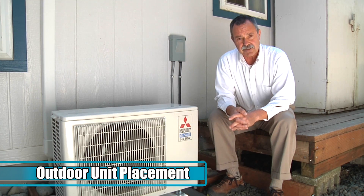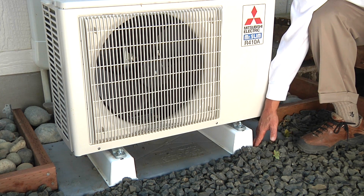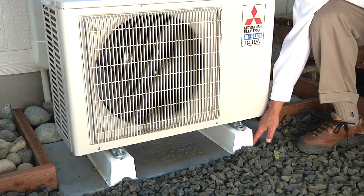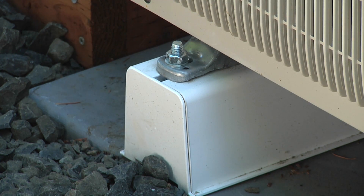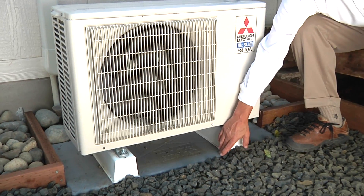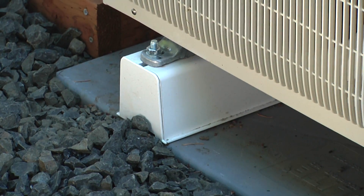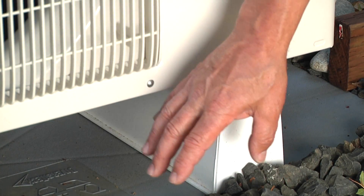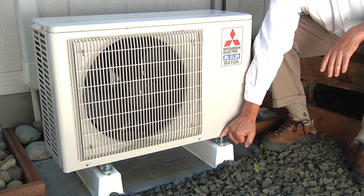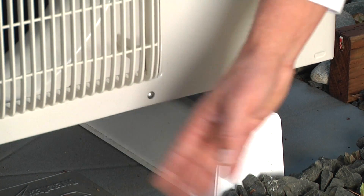The key to getting a good unit install is to start with a good stable foundation. As you can see here we have a good pad that's connected well with the ground. We have these risers and then the entire unit is bolted through the riser into the pad. This allows for adjustability and a good stable operating system. The space is very important — without it we could not clean any debris that might block the unit from underneath. In snow the risers might be a little higher. Additionally, in the wintertime ductless heat pumps, like all heat pumps, go into defrost and that produces water.